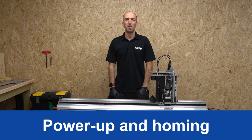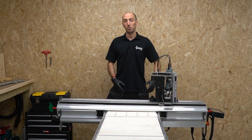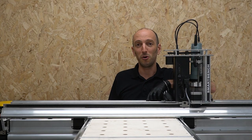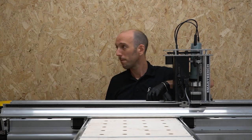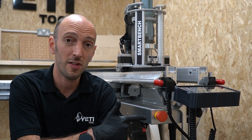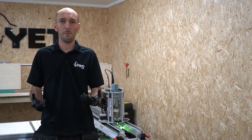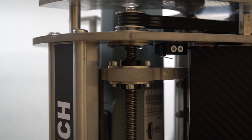Now we've got the dependencies out of the way, let's turn SmartBench on. I want to do a manual square, so before turning it on I'm going to pull the lower beam up against the legs. We've got a video on homing and squaring if you want to learn more about the theory. The beam's nice and square against the legs now, so I'm going to turn SmartBench on by rotating the e-stop button. Once the console's booted, accept the safety information and — because we're doing a manual square — say no to auto-squaring, then press the home button to start the homing procedure.